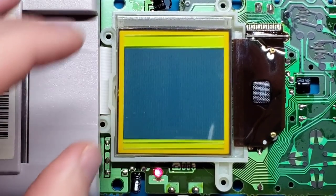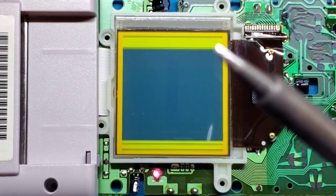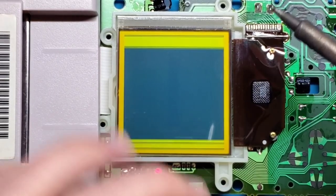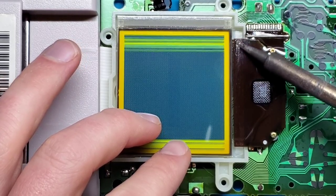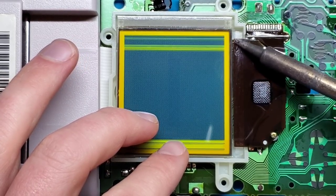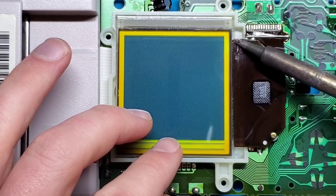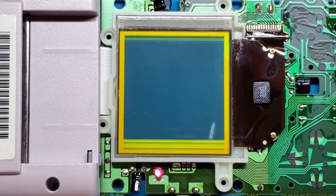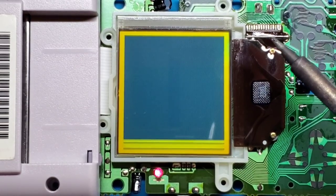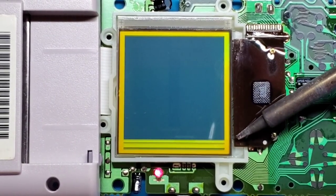Take your soldering iron — you're going to want a kind of flat, small chisel tip, like this one I'm using. Simply rub over it a little bit, working your way up and down that side of the connector. You'll see it's turning dark. The lines are probably going to come back once it starts to cool and you'll just need to go back and touch them up again. That gives us an opportunity to move to the other side.